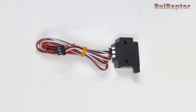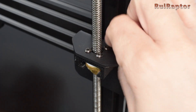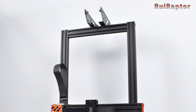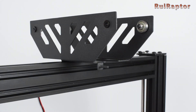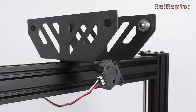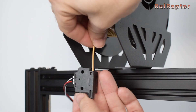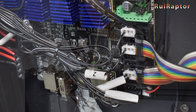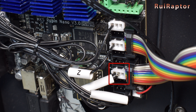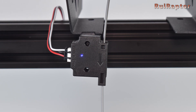The filament sensor wires on our machine came uninstalled, but we were informed that in the future all these machines will be sent with the filament sensor cable already installed. The filament sensor is placed on the filament spool holder. However, something seems to be missing because the sensor is not properly secured and easily falls down during printing. During the first tests we noticed the filament sensor was not working. During our troubleshoot, we found one of the pins from the connector on the board side was loose — easily fixed by pushing the pin in — and the filament sensor started to work as expected.